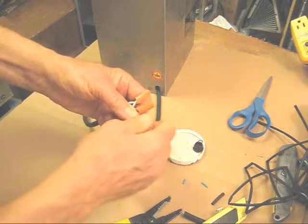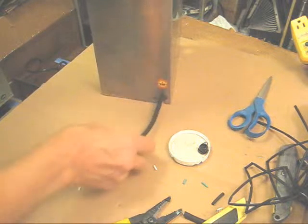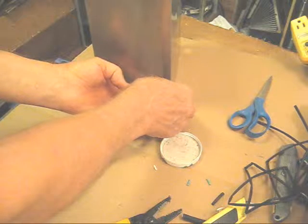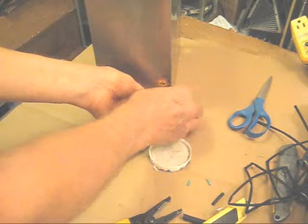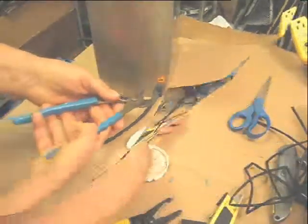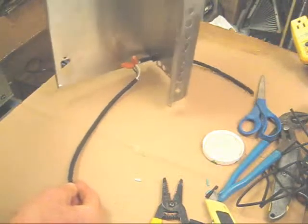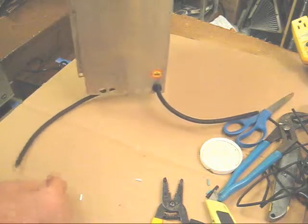Now what I would suggest is to put all of the repaired wires inside the sheet metal. Then with the grommet that comes on the power cord on the juicer, I'm going to have to crimp that on tightly with a pair of pliers, and then push that in and force it into the hole as I'm doing here. It may not be this easy when you do it, but there's the fix. I'm just simulating this, and inside you will see you will have the wire nuts. Just make sure they're on tightly and not exposed to the outside — and only you will know.